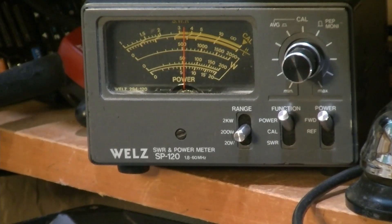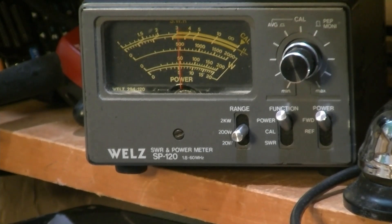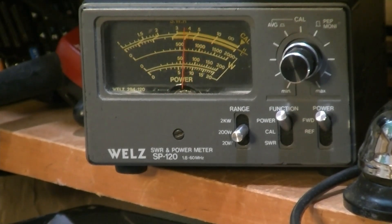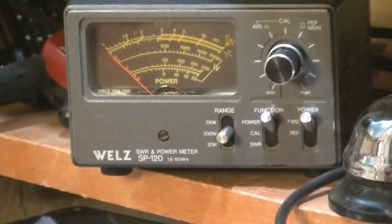I'm going to put it back in tune mode and check my grid drive adjustment. Back to high power and about 60 watts. Now let's see if we can get this thing to modulate properly. Hello. Hello. Got to adjust my scope — W6WUH. Not too shabby.